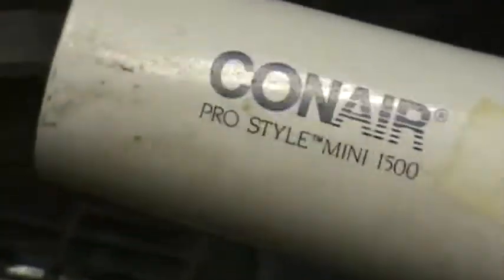So what you can do if you don't have a big blower, this thing I built for about 40 bucks. Here is just a Conair hair dryer. You can get a hair dryer from any store as long as it's a pistol type. Because what you're going to do with this is stick it inside the galvanized pipe. See, this here, right here, is your airflow, but you'll need to get a rubber piece of hose and a clamp to clamp it there, and then you stick this inside the hose, and that will pretty much send your air to it. I got a 12-inch nipple.